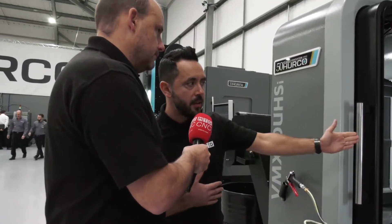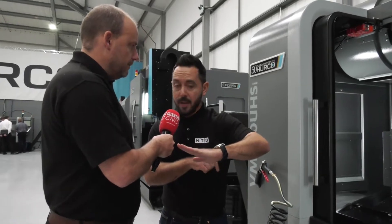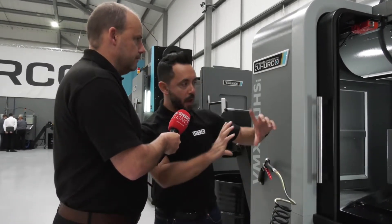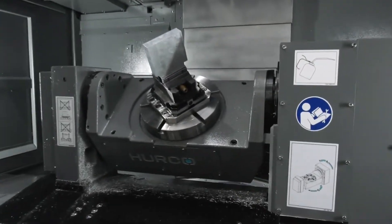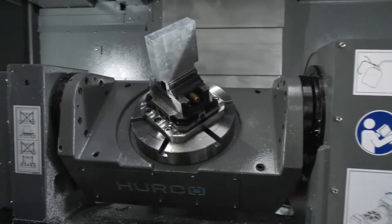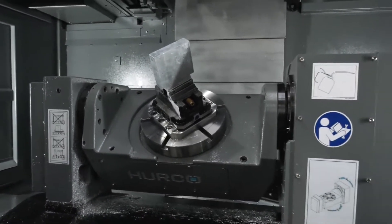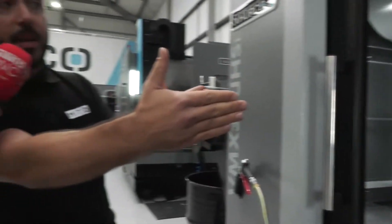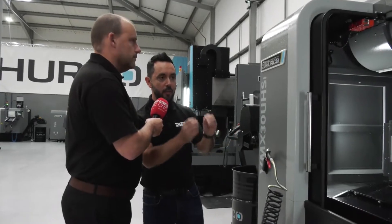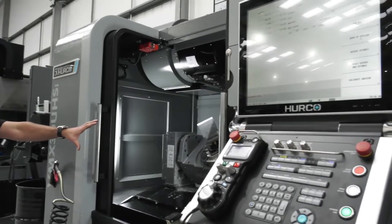It's deceiving — really when you're doing 5-axis work, 90% of the time your 5-axis table is at the 90-degree plane, so you've got more Z-stroke. You'll be tilting the part around the Z-axis and then occasionally tipping the part up to get your angular features. You've got enough capacity to do the majority of 5-axis work that you'd like to do, but you do have capacity limits on this configuration because of the trunnion. You need to think: if I've got a family of parts of this size, this is the biggest 5-axis part I'm going to do, and it fits within the envelope of this machine — brilliant.